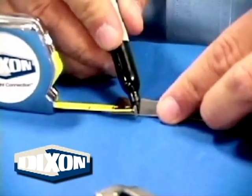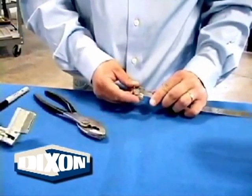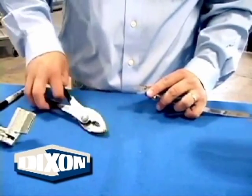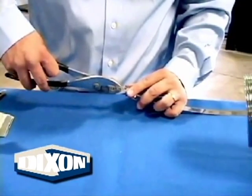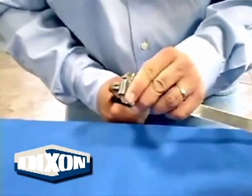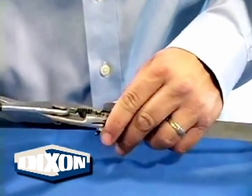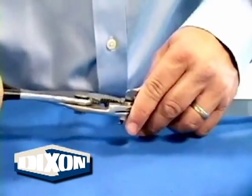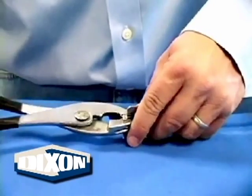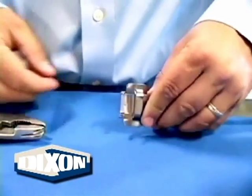Bands and buckles are to be the same material and width. Place a mark on the strap ½ inch from one end. Slide the strap through the loop of the buckle, making sure the buckle ears are up and closest to the end of the strap. Using pliers, bend the ½ inch of strap down and under the buckle. Crimp the strap tightly, making sure not to squeeze the buckle loop. This allows the end of the strap to tuck under the buckle, as shown here.